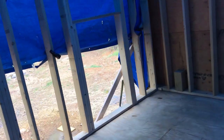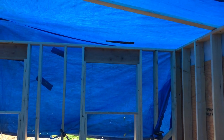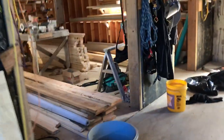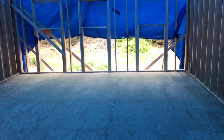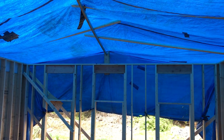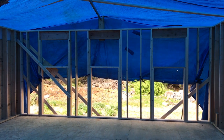The next step is to do a little more work making sure everything is plumb, and then we can start laying the ceiling joists — I've got those sitting over here. We've got a bunch of 22-foot 2x10s that we'll run across here 24 inches on center, which will match up with the rafters at 24 inches on center, and then we can start framing the roof. We'll see that next time.